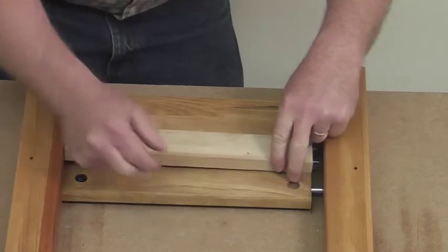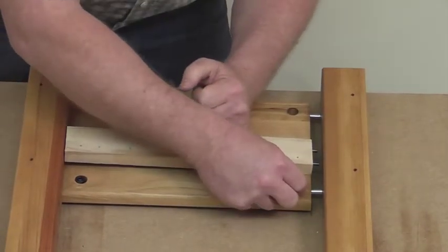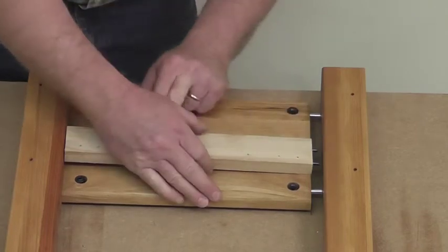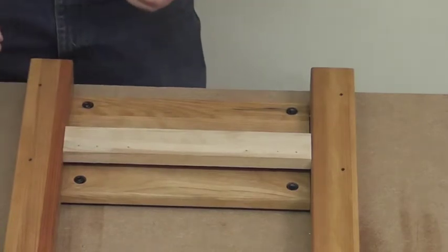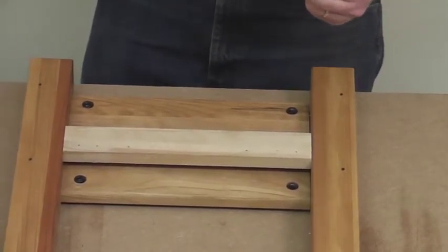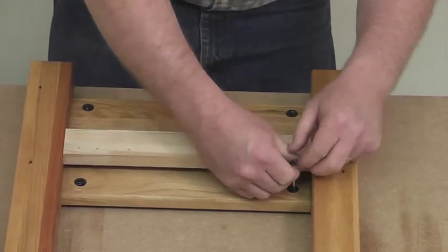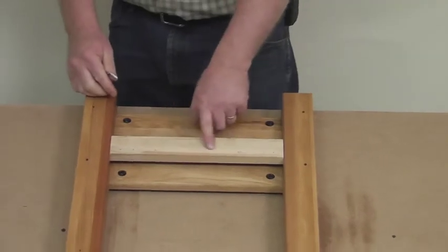Alright. Now with that, I'm going to drop the barrel nut into the hole facing the right way. It has little hash marks on the top that you want to line up. Do that here. You can actually hold this glide support into position and squeeze it together, just like that. And then you take your set screws, slide them on your wrench, and then tighten this side down. Now this side panel is complete, ready for a drawer glide.